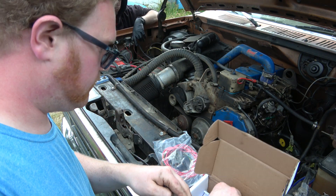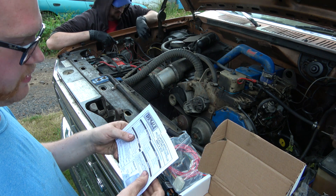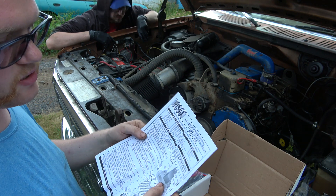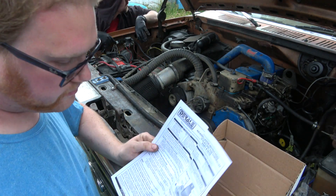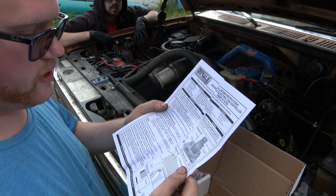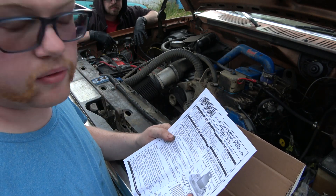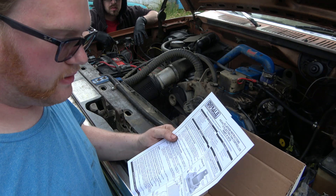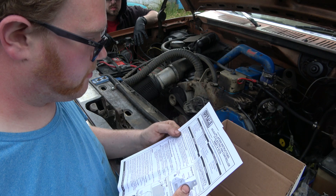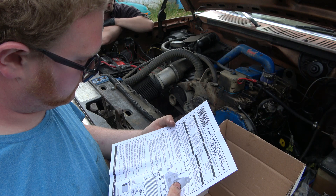This should have an input for AC - a turn-on input for AC if I remember correctly. So this is adjustable. You can adjust it. The range is 120 to 240, and I'm probably going to adjust it to kick on around 185 to 190. Give myself a little bit of room. I might just play with it and see what it takes to get it to run and keep it cool.